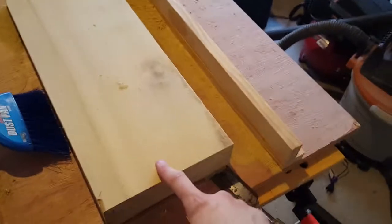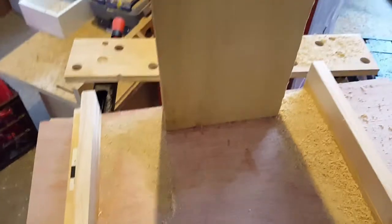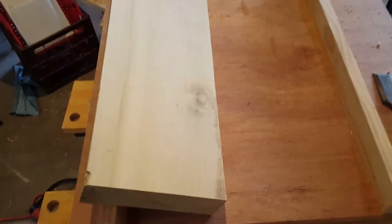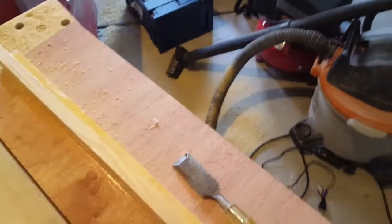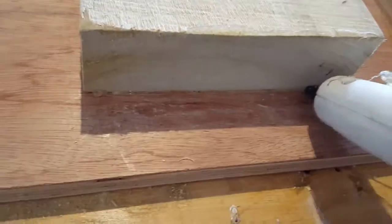To release the board from the surface I use a little chisel, a tiny hammer, and a razor knife to cut and pull it up. This leaves a bit of a nasty edge on the wood and the board surface. If I knew how good hot glue stuck things together for woodworking — it's kind of a nightmare getting it off. I'll clean this off, then flip it over so the nice flat side is down and apply a bead of hot melt glue on the front and back.